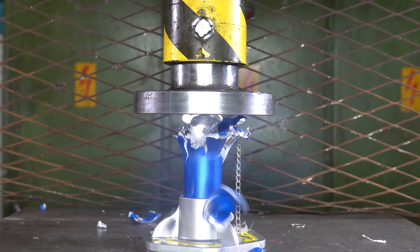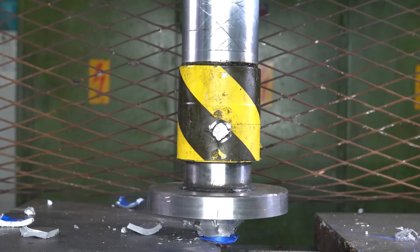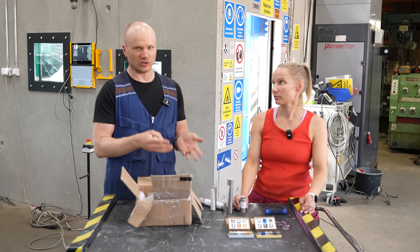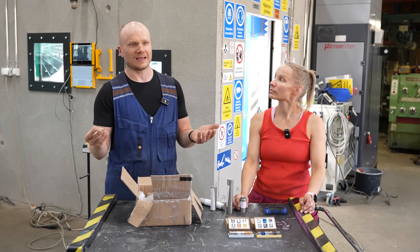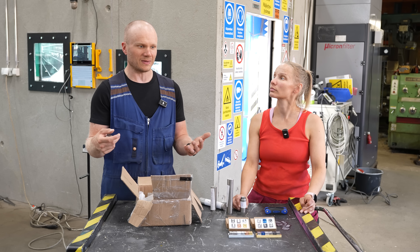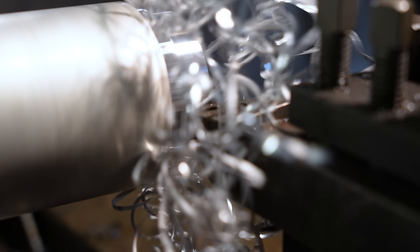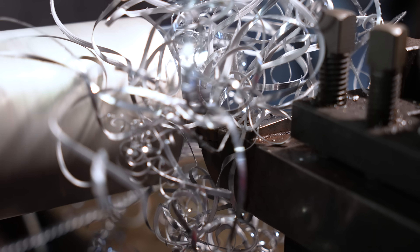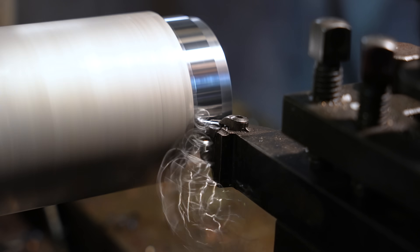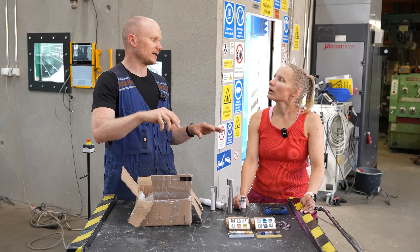Aluminum — it's softer than steel, but it's also quite exploding. Aluminum is one of two elements that have broken windows in this workshop, so that's a pretty remarkable element. To machine, there are two sides: it's quite soft, you can go really fast — up to around 800 meters per minute, maybe four times as fast as with steel, and you can take thicker cuts, so it's nice to machine. But it's also one of those annoying sticky elements where you have to have a really sharp tool bit. If you do a lot of aluminum you should have an aluminum-specific tool bit, because if you use that for steel it's going to break down. And do you know the weirdest lubricant that works with aluminum? 100% pure ethanol — you can pour vodka on your workpiece and it gets all shiny when you're machining.